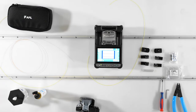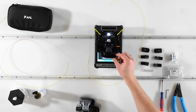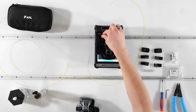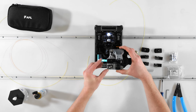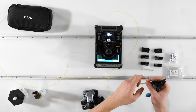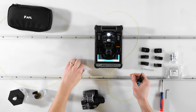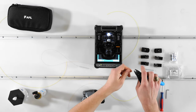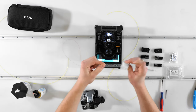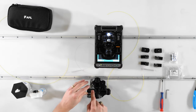The sheath clamps are the spring-loaded clamp arms on either side of the electrodes that hold the fibers in place during the splice. The AD50 adapter plate comes pre-installed on the CT50 from the factory. To splice in this configuration, first slide on your protection sleeve, then strip about 35 millimeters of the fiber with the smallest hole of the stripping tool. Clean the fiber with the cleaning solvent and place it in the V-groove of the adapter plate.